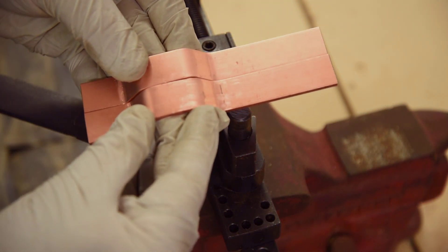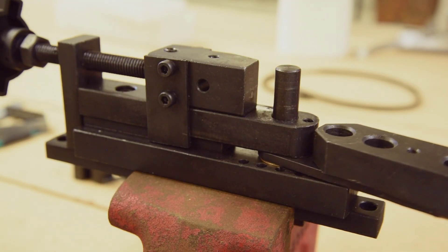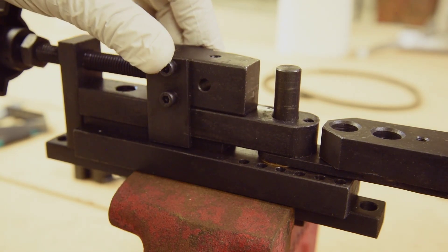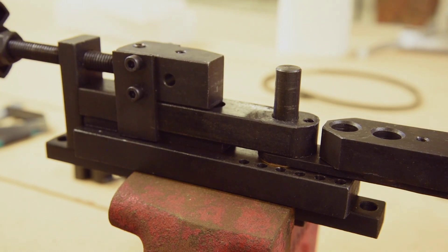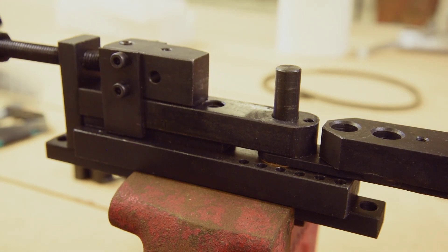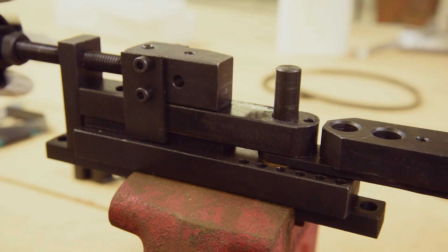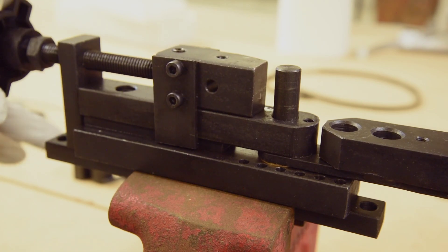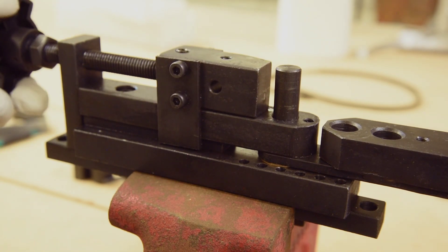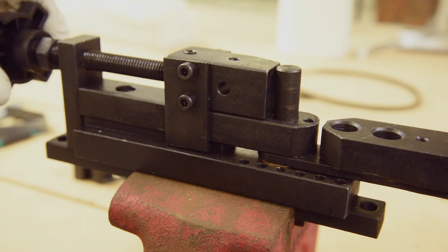I'm pretty happy with that. Now I just have to make two more. Does anyone happen to know if this is maybe a copy of an old tool design? My conclusion on this mini-bender: fit and finish, I would say poor; price, I would say excellent — costs less than $60 delivered to my door. Would I buy it again? Unquestionably yes. Great bang for the buck with one caveat: if you are going to be bending flat items, you will need a spacer to hold the handle square. It would be interesting to know if the higher priced ones have a thicker handle. Thanks for watching, and have fun bending.